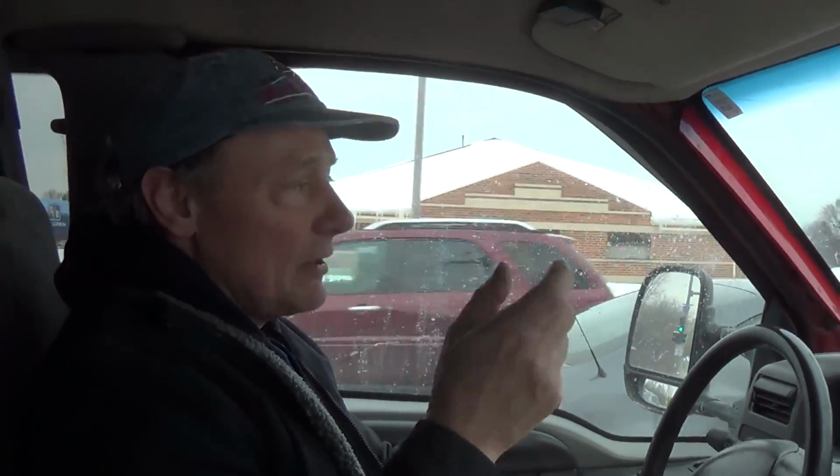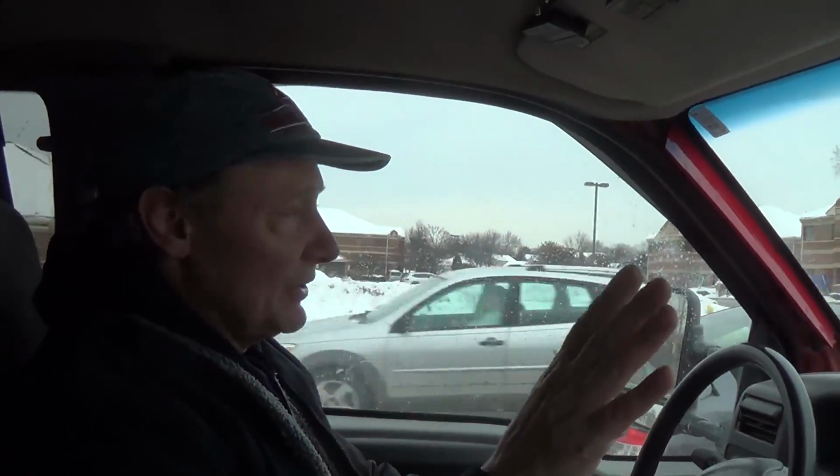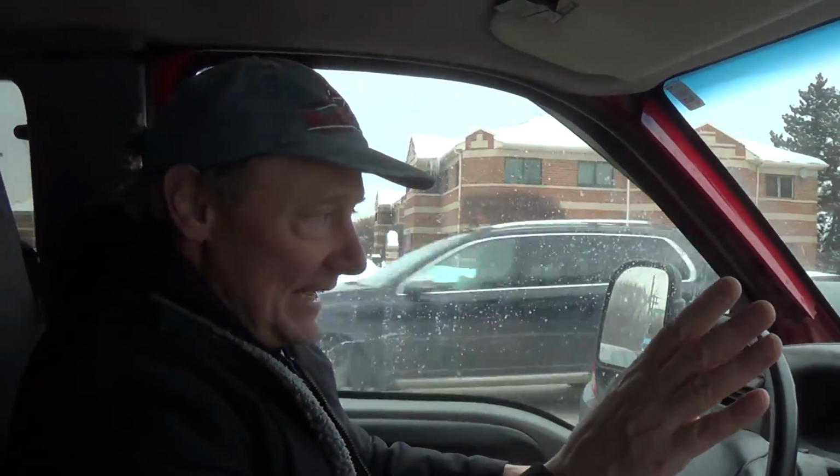So when I was using metal corner bead, I still nailed it on. I would nail it on today. I would not even think about screwing on corner bead today. I would still nail it on. But I don't use metal corner bead anymore. I just don't. I repair it, but even when I'm repairing it now, I'm repairing it with the tape on, super wide tape on bead.